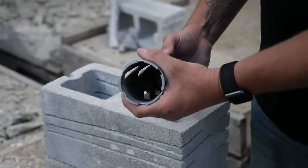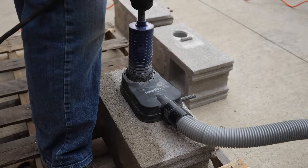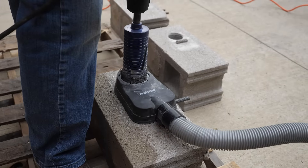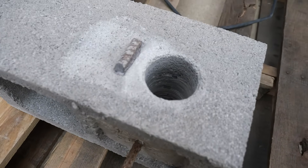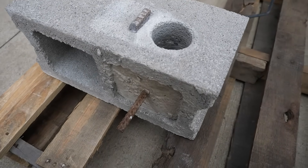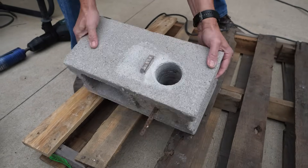For now, let's focus on dry coring with a diamond bit, because if you are comparing to carbide, we really are comparing to dry coring. Unlike the carbide, diamond bits can continue through that steel or rebar without the need of switching it out. This is because the bits are not pounding the concrete — they are technically grinding it. So grinding metal works pretty much the same. As you can imagine, it saves time, and that's important if each hole takes 10 to 15 minutes and you've got multiple to do.